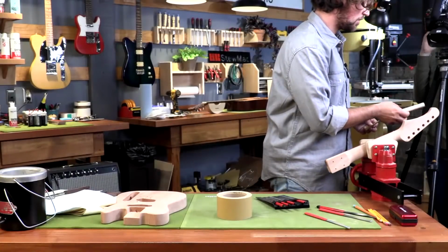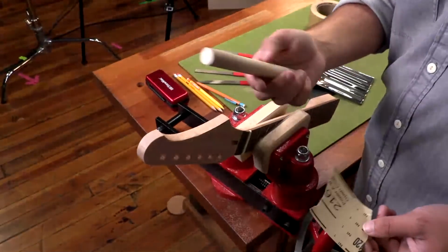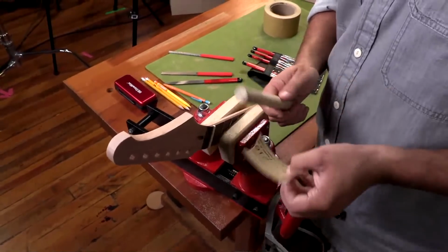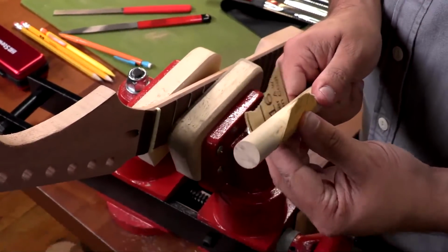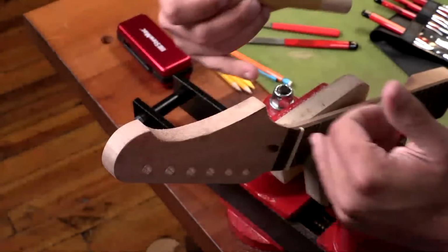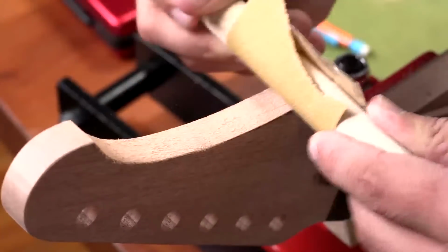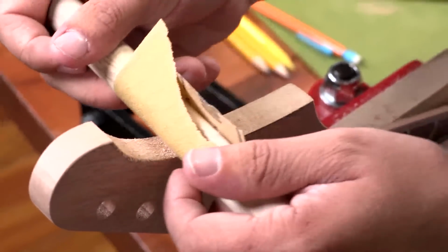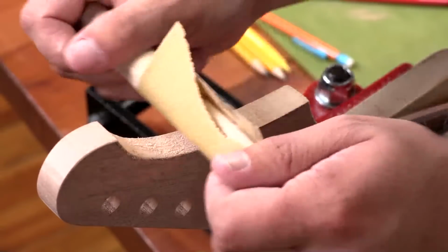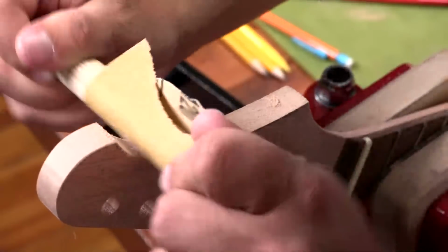So I just have a wooden dowel here. I cut off a scrap from a nice big piece I bought at Hobby Lobby, and I got a little piece of 120, which is the grit I'm going to start at to get some of these filing scratches out. Theoretically, when your teeth marks from the bandsaw are gone, that is when you would start sanding. I like to use a dowel because it runs into this curve a lot smoother. Yeah, absolutely, that's what I was going to say too. It just makes it so much easier to use if you're working with a dowel.